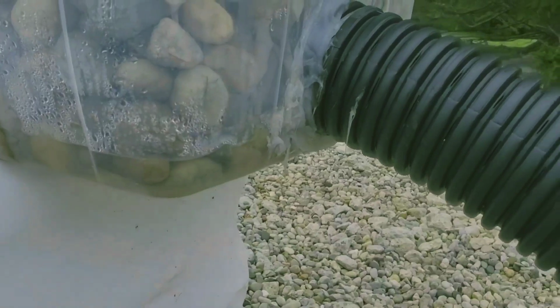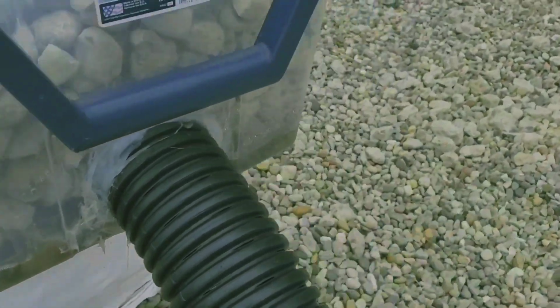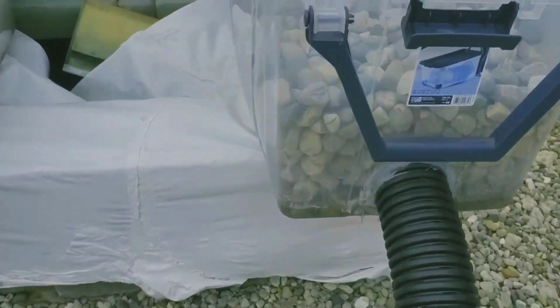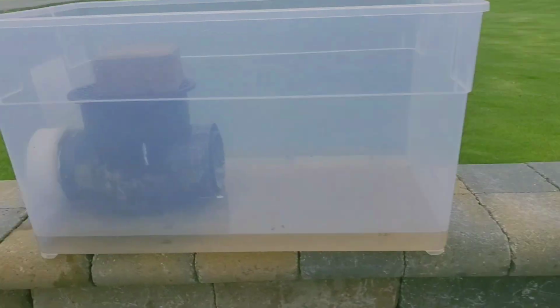Now, this happens to be the peanut pipe, guys. Check it out. There's your peanut pipe. It doesn't have a lot of aggregate, but it has some. So if you put stone under your French drain pipe, you leave that much water in your trench. Guess what? Trees can sniff that out from 50 feet away. So this thing's on a timer. It's got an expiration date. All right, so let's keep moving.